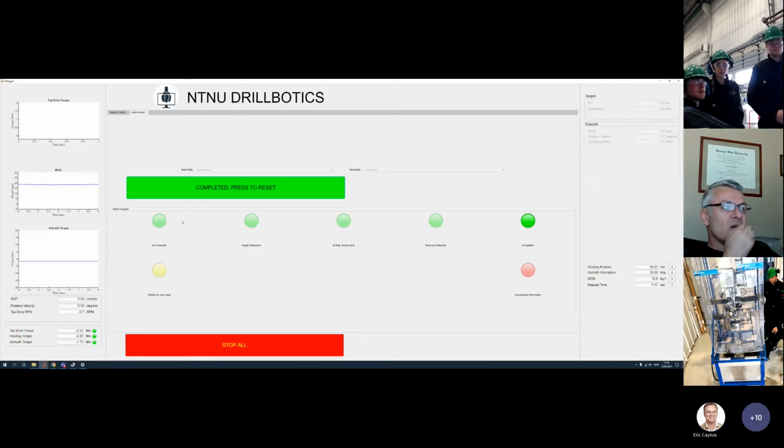Yeah, we studied that option, and we know that since it's a fixed bend, as long as we are building up, if we change the orientation or change the azimuth, it will also change the build-up rate. So you need to play between the build-up rate and the turn rate. We looked through that, but we didn't have time to completely apply that part. But we went through that in the technical part and in the theoretical part. Okay.